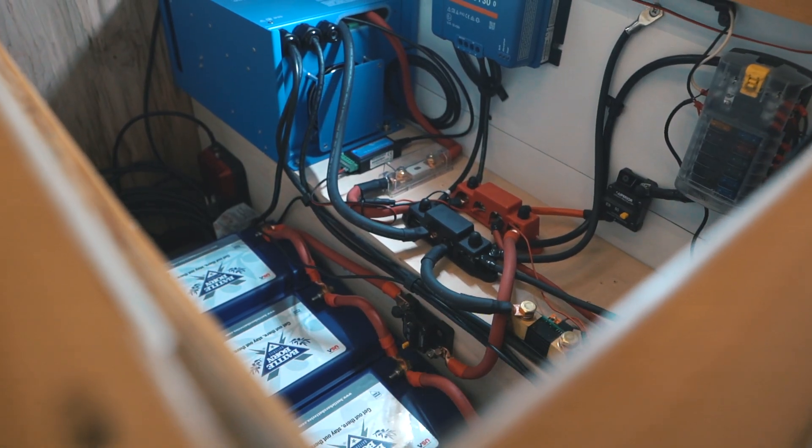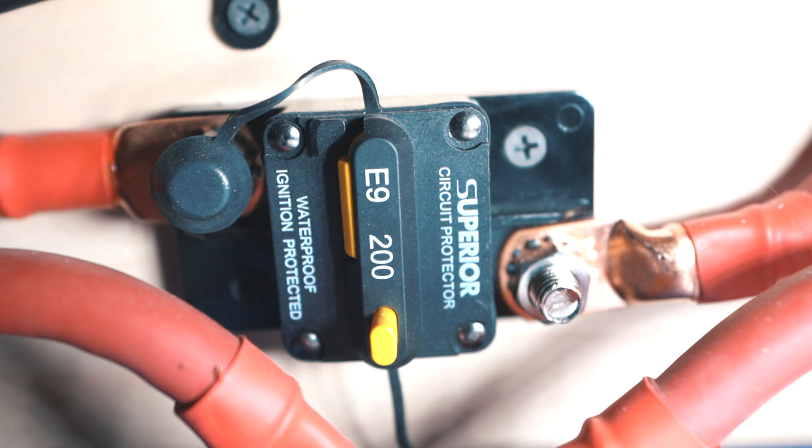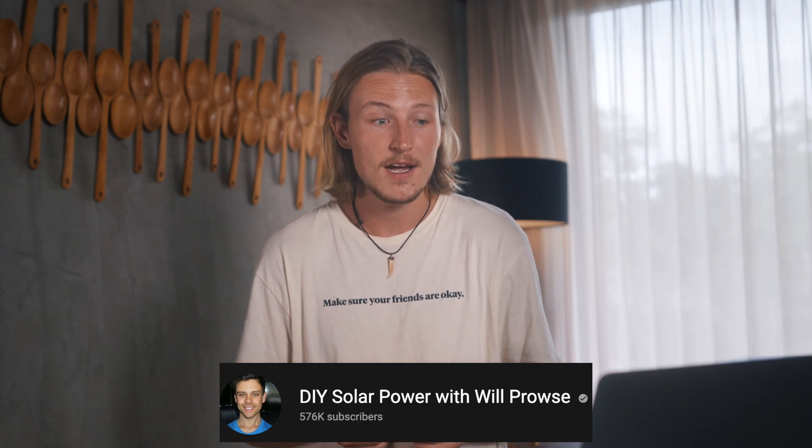Negative from the solar panels goes to your negative bus bar; positive from your panels goes to the positive bus bar. Same for the DC-DC charger that comes from the front of the van — positive to the positive bus bar, negative to the negative. For batteries, same thing — positive to positive, negative to negative. Some people put their batteries in series, but I would recommend going in parallel: connect all your positives together, then connect all your negatives together, then connect to the bus bars. In my system, all the wires go through breakers, which protect each component so a short on one side doesn't reach the bus bar or inverter. I'm not going to get into specifics — Will Prowse has a bunch of really good system designs on YouTube, and the specific breaker depends on which component you use.